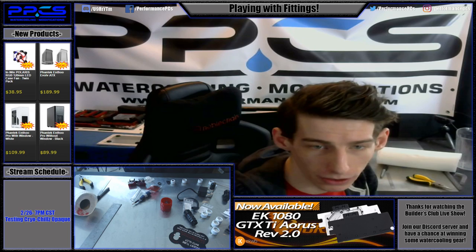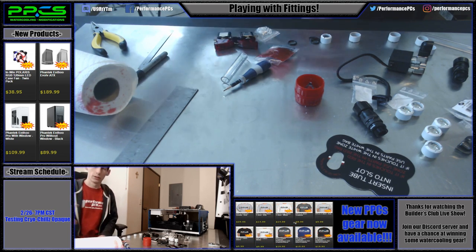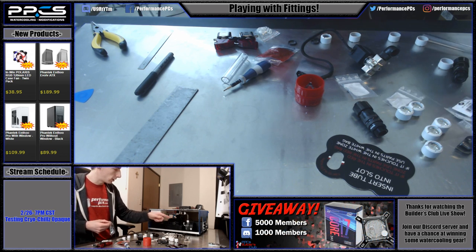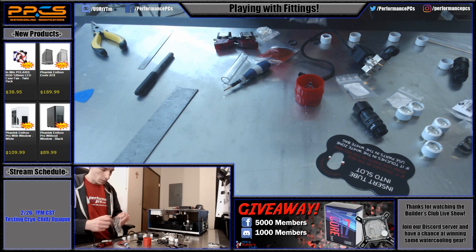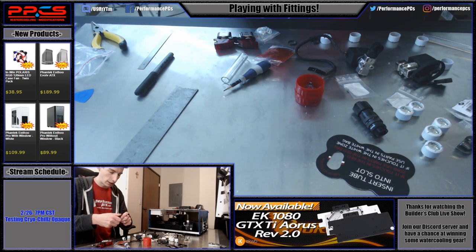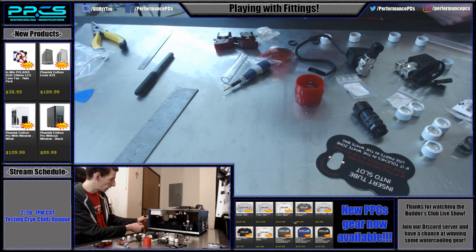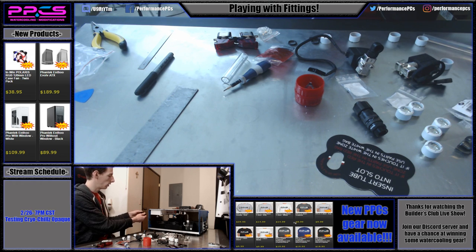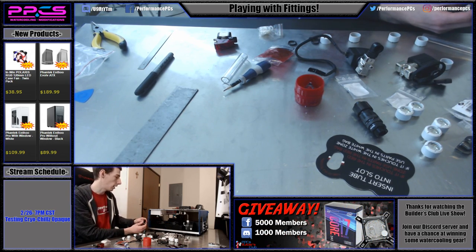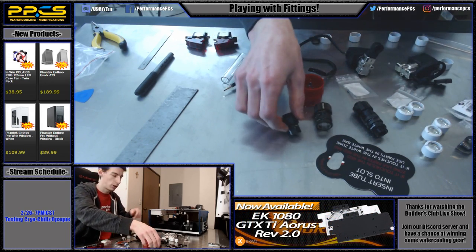So let's see. Let's switch to... Is this the one we want? No. We want this one, I think. Yeah, that'll work. So these are the magnetic ball valves from Alpha Cool, and that's what I'm working on figuring out in this area here, because they have to come off the radiator. These are for bypassing the radiator. I've got these pretty fancy coolant quick disconnects, and it's actually a quick disconnect and a bulkhead. So this fitting is going to go on the front of the case, and then I'll be able to put some tubing to another rad and just connect it up. And with the magnetic ball valves and these handy switches, I can just shut off flow to the radiator and therefore test the radiator outside of the loop. Kind of complex, but I think I can figure it out, but I'll appreciate anybody's help or input.